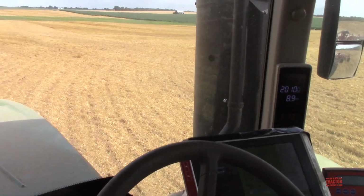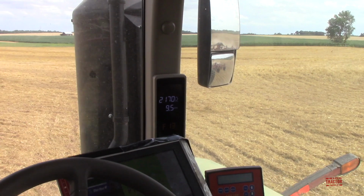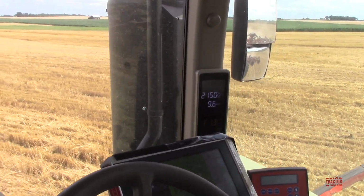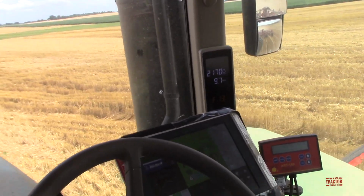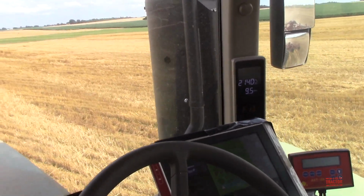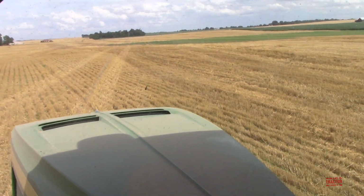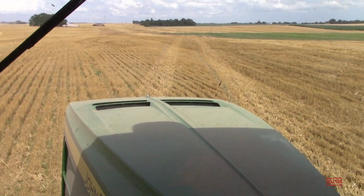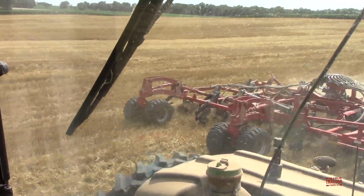And the speed, a regular conventional corn planter, you couldn't run those kind of speeds. Yeah, we're getting up to over 9.5 miles per hour now. A planter should probably run about 5 to 6. In the conditions we're in right now, probably 5 would be better. So, yeah, especially when you get the sun out here, 90-degree days baking the ground, it's nice to be able to tear right through it. We'll look back there and show you the hoes digging right into that straw.